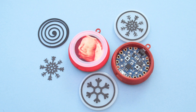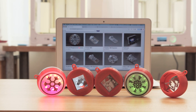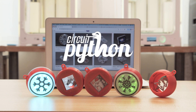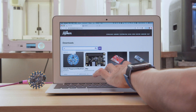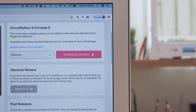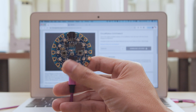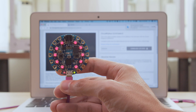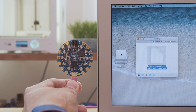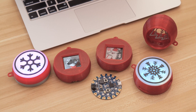The latest version of Circuit Python has really nice Bluetooth support. Go to circuitpython.org and check out all of the supported hardware — you can search for the Circuit Playground Bluefruit and download the latest version. Double press the reset button to get into bootloader mode. You can install Circuit Python by dragging and dropping the UF2 file onto the USB drive, and with Circuit Python you can quickly get your projects up and running.